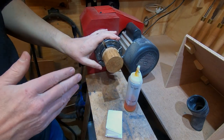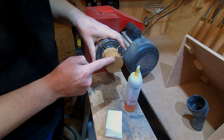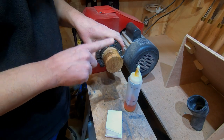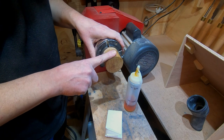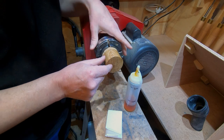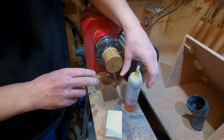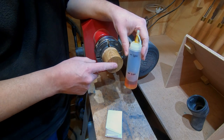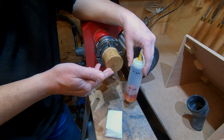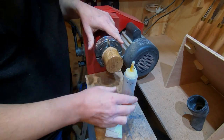I have a piece of oak on the lathe to demonstrate how I use shellac. I've gone over this section with a skew to smooth it out and faced off the end grain. I've sanded through the grits to 600. Not essential, but I've given this two coats of sanding sealer, sanding back with 600-grit paper in between. The reason is that introducing moisture causes grain rise — by giving it a couple of coats of sanding sealer first, the shellac should have less impact on grain rising.